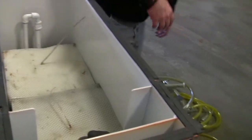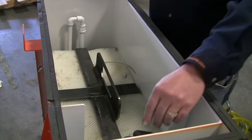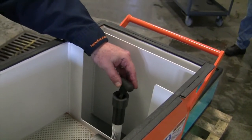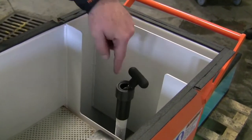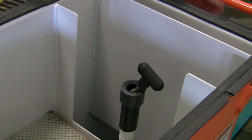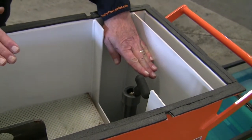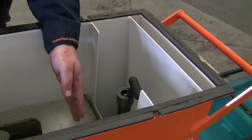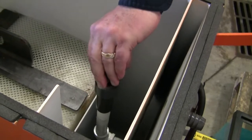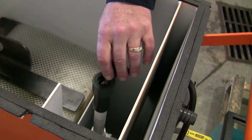Eventually you have to clean the media, but that could be several months away, and they really will never need to be replaced. You put it back in and put the bracket on to hold down the weight. The last part to look at is this piece — this is where the tramp oil that comes out of the coolant discharges out of the tank. The coolant level stays constant based on the coolant outlet height. Oils that separate will rise to the surface and be stopped by this plate so they don't leave the coalescer. The coolant, which is heavier than oil, goes under the plate and up and out the discharge hose. We'll adjust this piece so it's just above the coolant level, letting a nice thick layer of oil build up before it discharges out the port.